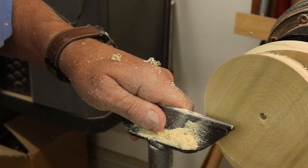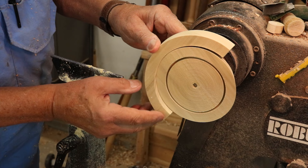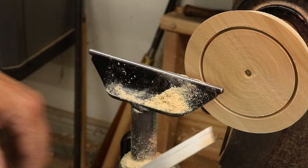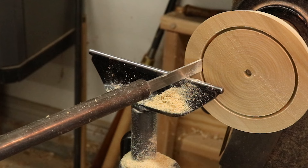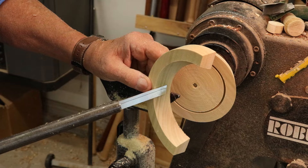Now I've gone over to my band saw and simply cut that ring in half. It came off like that. There's my kerf, and I've started another cut with this parting tool right in here. I didn't go down very deep, but that just illustrates that on this area right here, if I had a tool that was taller, I would bind in that kerf.